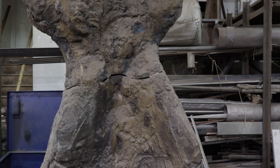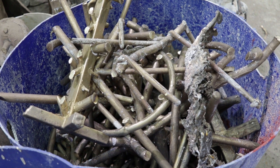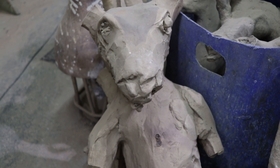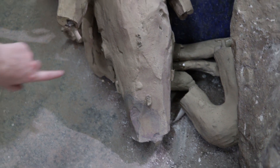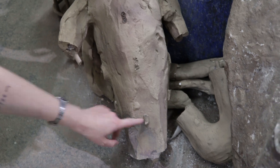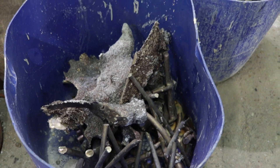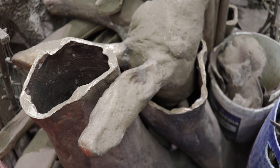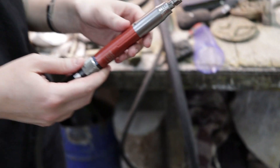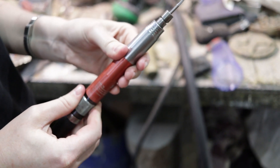This is what the bare bronze looks like when it's not been touched. All the runners and risers have been cut off, which is called fettling. You can see stubby areas like this — these areas are where they've been fed. All of that gets chopped off and it gets sandblasted to get rid of the majority of the ceramic shell. Then it's ready for a more experienced metal worker. I use tools like this — it's just an air tool, a rotating air tool, like a dentist tool.